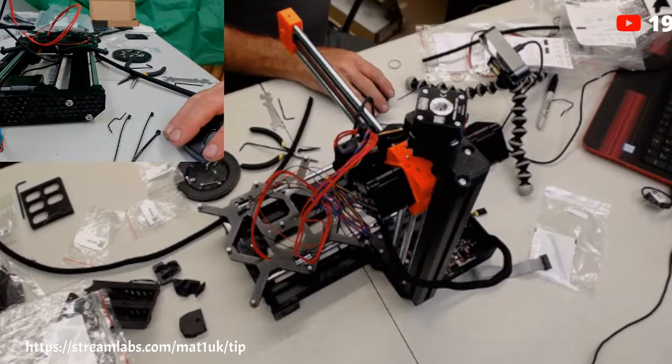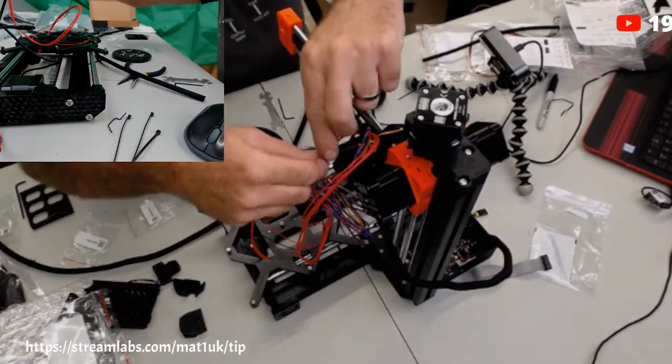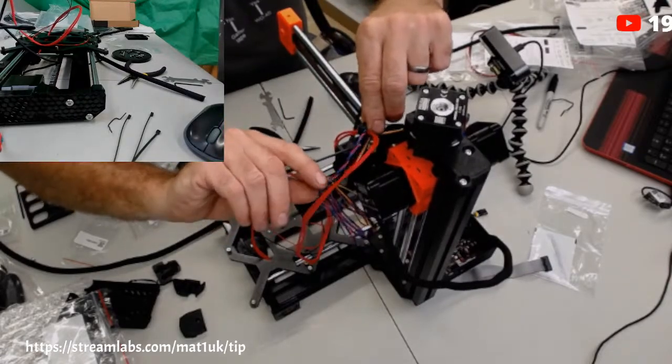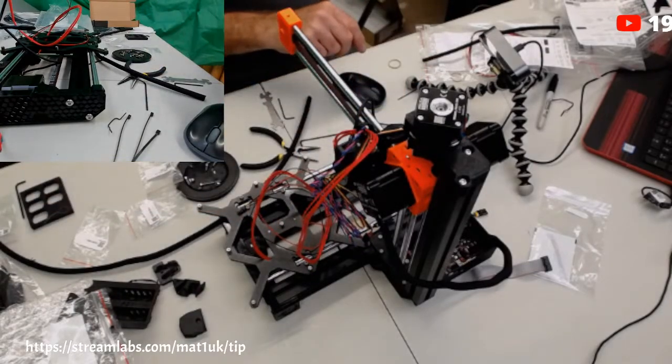So the fan cable and everything else is through it. Slide down the mini fan spacer clip. Done that, yes. The mini fan spacer clip must still move freely. That's too tight then. So let's back it off. There we go. That's now moving freely. Yeah. Merge all the cables. Guide them over at the textile sleeve around the cable bundle and slide it into the mini fan spacer clip so that it extends over 2 to 5 millimeter textile at the other side of the guide.